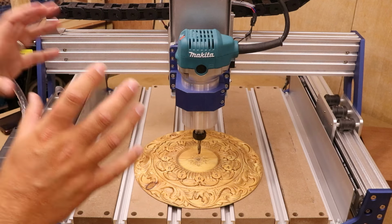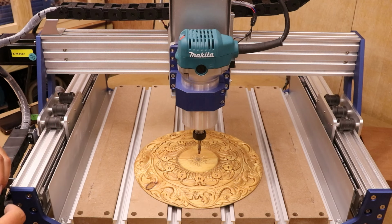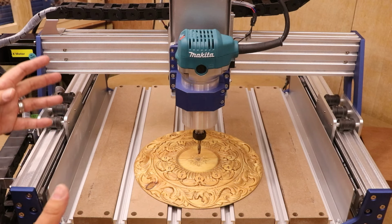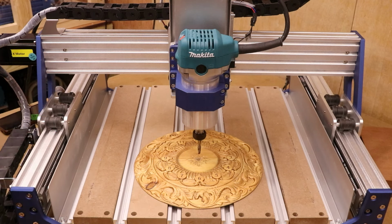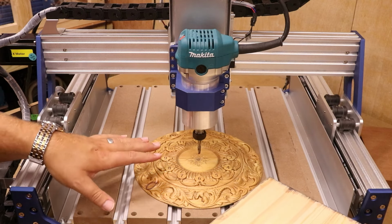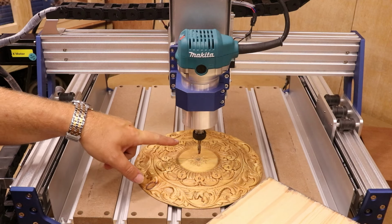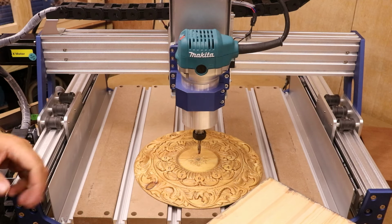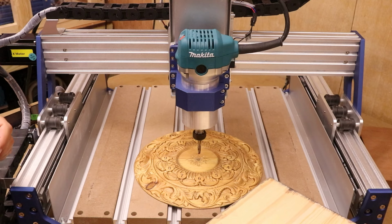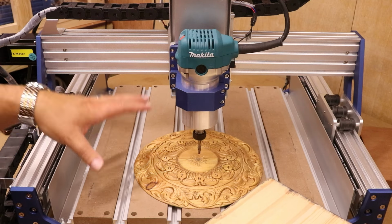So one of the things I like to do, no matter what material I'm using, is keep some sort of offcut. It doesn't need to be big, it can just be like 1 inch by 1 inch, but ultimately if you have an offcut of material of the same thickness, you can bring that in, set the Z height accurately off that, and it should then match obviously the material that you've just been machining and get the same consistent results.